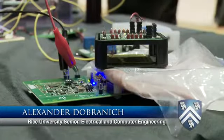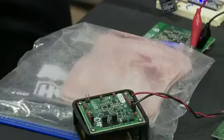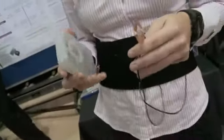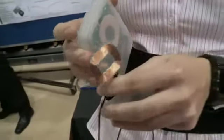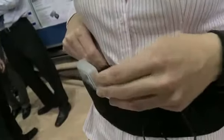That motor is being powered right now from an external power supply, but there are no actual wires between the external and the interior. We have an inductive coupling between two coils that is allowing this wireless power transfer. This is a model of what size the prototype would actually be when it's miniaturized and ready for implantation inside a human. This device is worn on the outside of the patient, and a current sent through this external coil uses magnetic coupling to transfer power into this coil, which would be implanted just a centimeter underneath the skin.